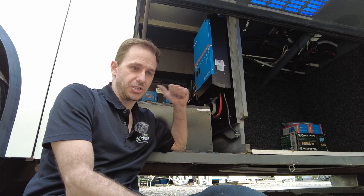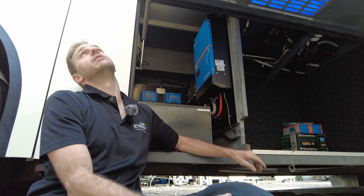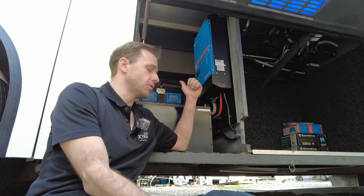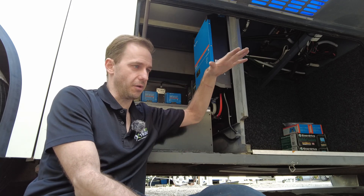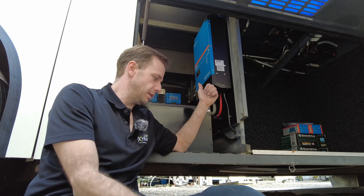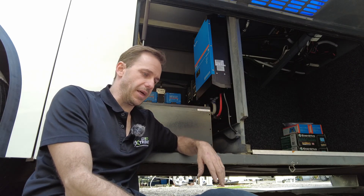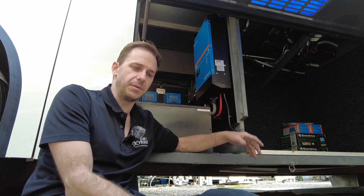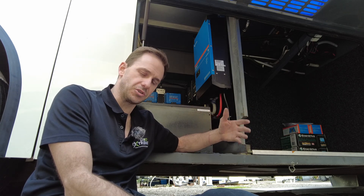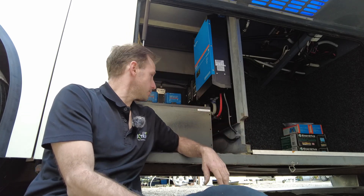We're nearly in the middle of winter and I just hit 1100 watts. I'm really happy to get that out of a wintery day with the sun behind a tree. The good thing about running split solar controllers is I've got two separate arrays on the roof. They're about 1400 watts per solar controller maximum — that would be 2800 watts total — but we're at about 2000, so only 1000 going into each controller. At 24 volts, that's well within range and they won't even work hard.